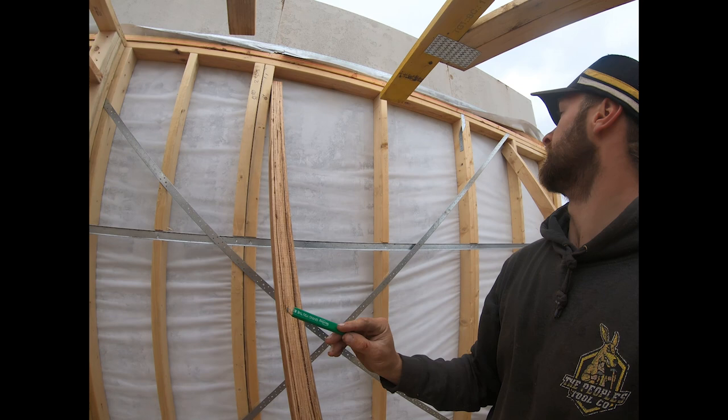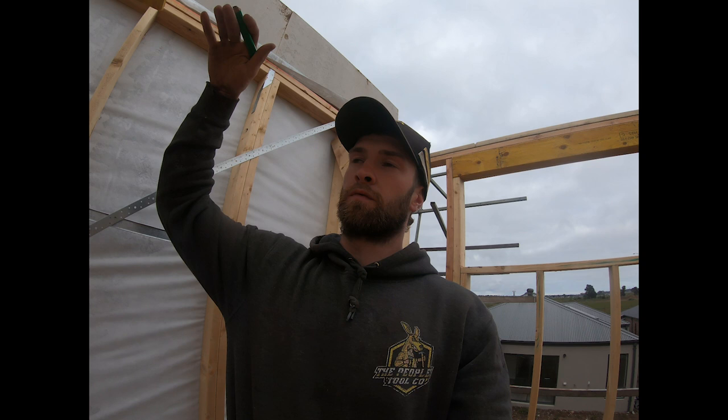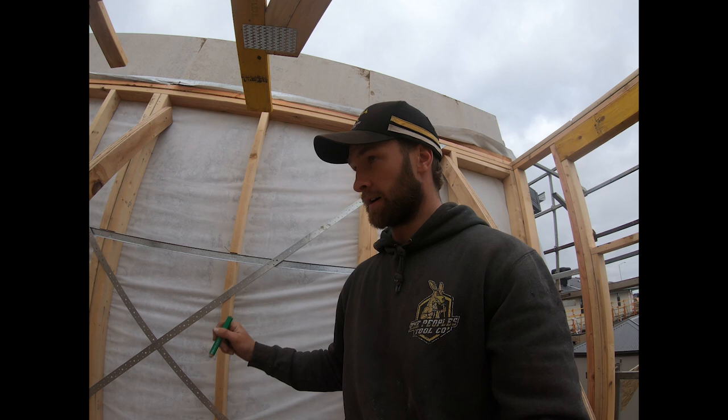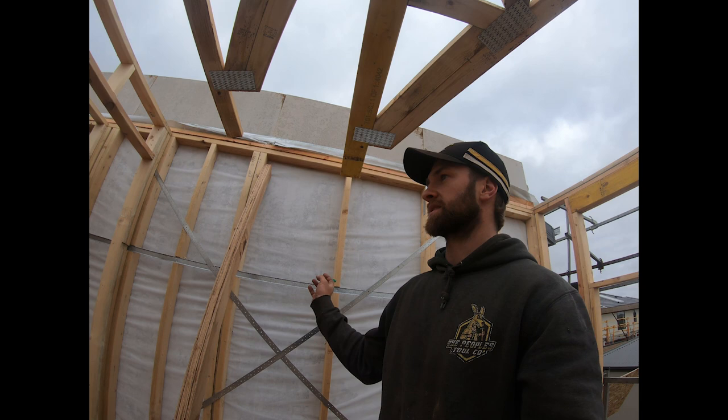And then the rest of them, this isn't as common because the stud spacings are so big, we'll point load it onto a stud as well. So all of the weight of the roof directly loads down onto something in the wall, and goes down to the bottom story as well. Usually we'll just do a double top plate and we'll put studs at 450 centers, not 600s. And that makes up for not having to point load everything, which is just easier.